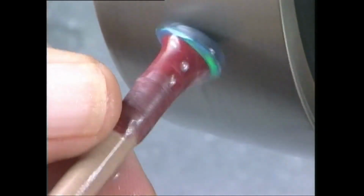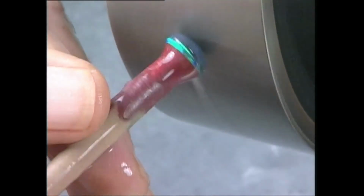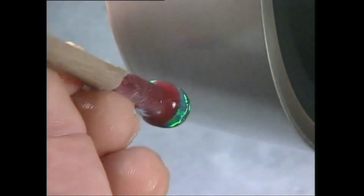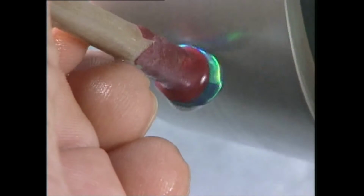Just rolling and taking the high points off before we actually finally spin this. There we go, we spin it from the edge right up to the centre of the back, creating a nice shallow dome on the back of the stone. Okay. Again, looking from the top, just a final trim here. Get rid of that little divot. We'll show you that shortly.